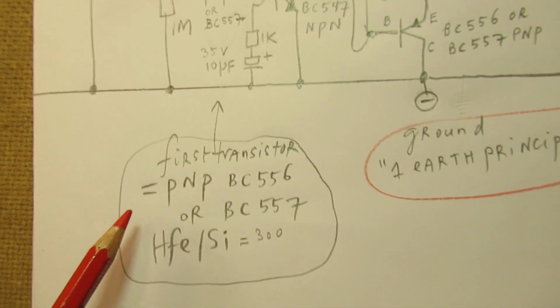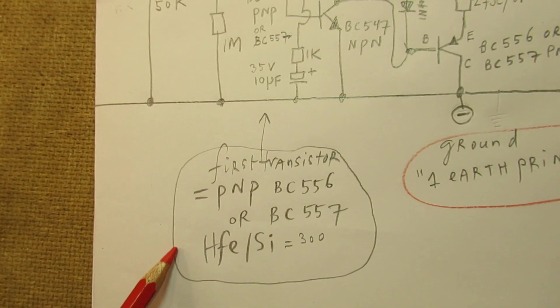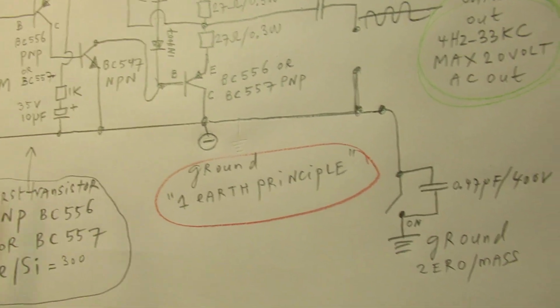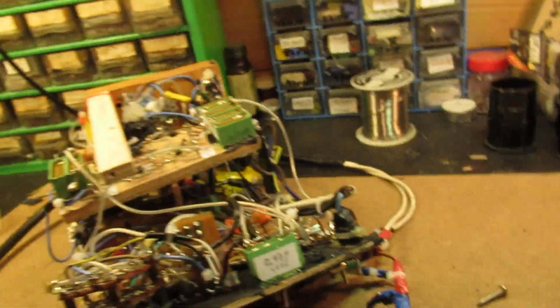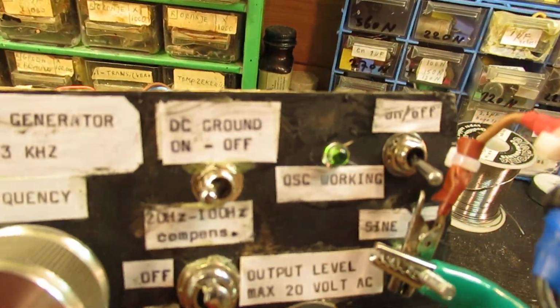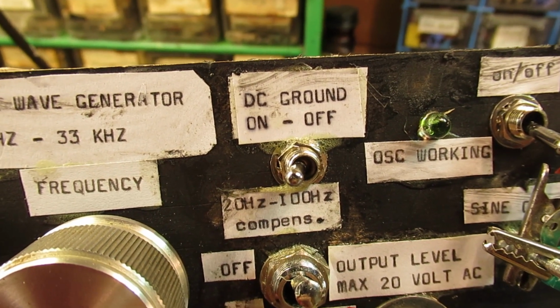The first transistor can be a BC556 or a BC557. They are both PNP transistors. And there is perhaps more to tell about how I made the ground, because the connection to ground, that's what I mean. You can see here on the front panel a switch with which you can set the DC ground